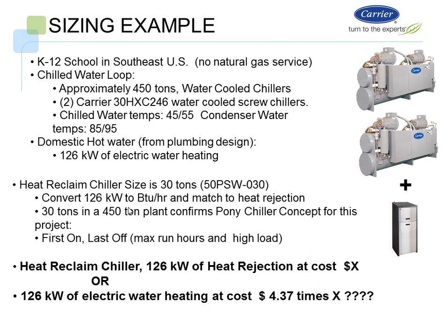domestic water system. And there are surprisingly a lot of electric domestic water heaters in Chicago. And a lot of times you find that they're running both of those simultaneously. You find a lot in hotels where they have an existing swimming pool, where they're running the pool heater and they're also running their chillers at the same time. So there are a lot of applications here, and I don't think we've quite captured and grasped this as a whole engineering culture here. We haven't done a lot of heat reclaim. It has started to grow, but we haven't done enough of them yet.